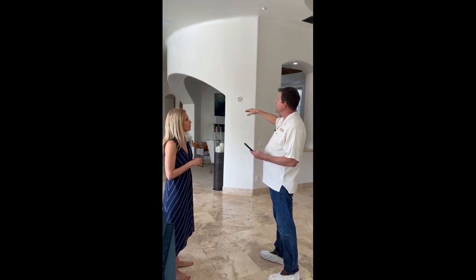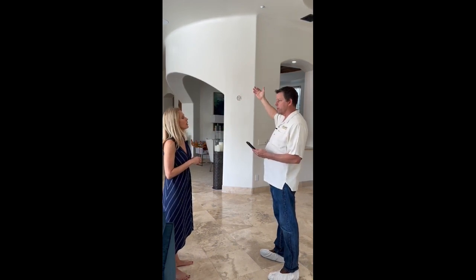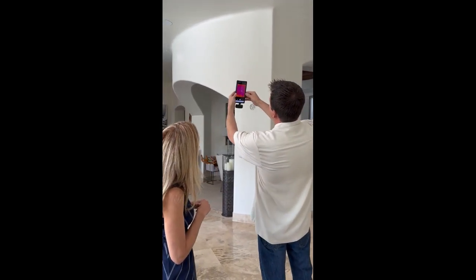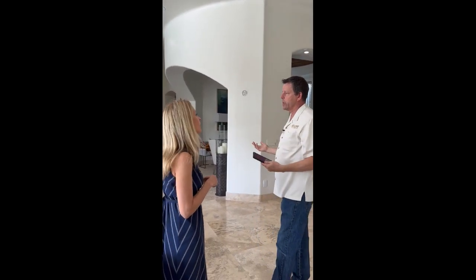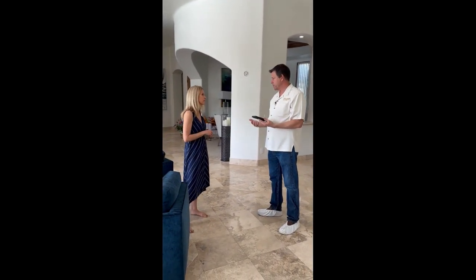There would be some really hot spots on this in the summertime when the attic is 140 degrees. It would light up and show a lot of red. Right now you can't see anything lighting up because the temperatures are all the same from the attic to the conditioned space, so it's really not showing us much.